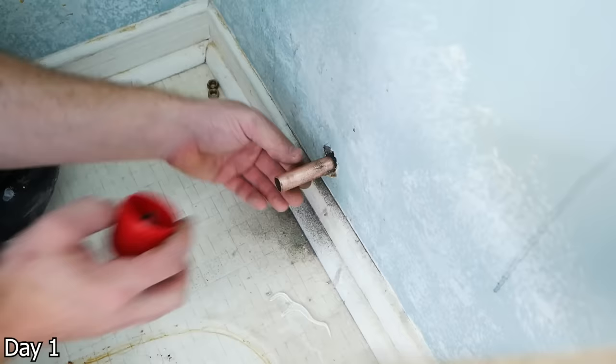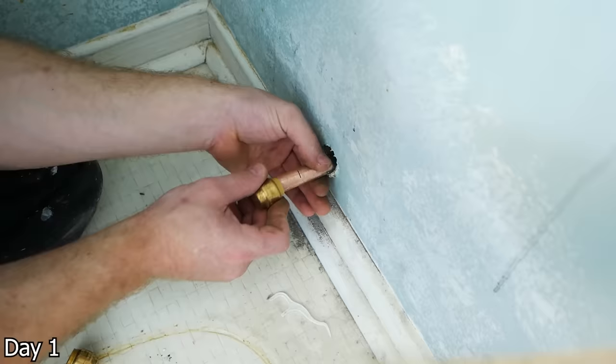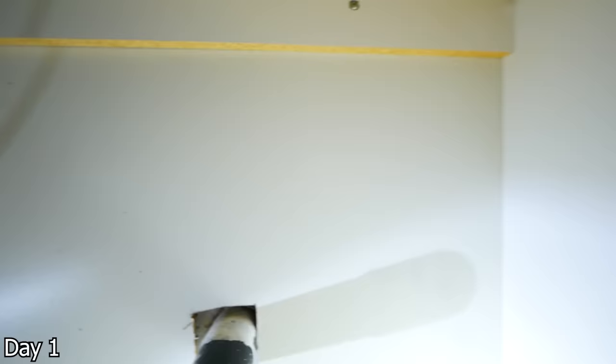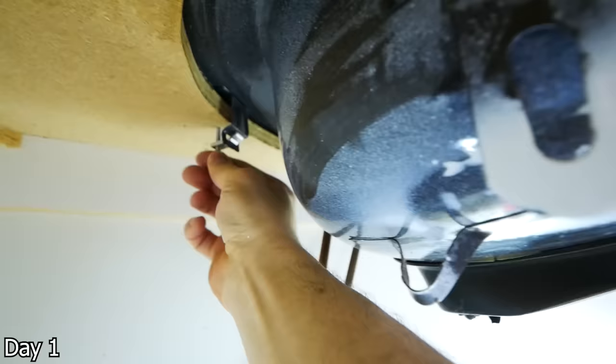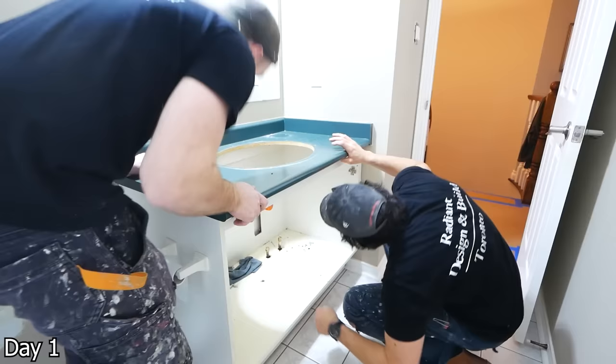Take a deburring tool to ream both the inside and outside of the copper line, getting rid of any sharp edges. Then use a SharkBite depth setter, put the tool on, make a Sharpie mark, and use a SharkBite end cap to temporarily cap those water lines. The vanity is typically held in with just a couple of screws going into the wall framing at the top. Remove the sink to get access to those screws, then cut any caulk joint along the top with a knife. With that done, your vanity should just come right out — just be careful and mindful of those water lines coming through small holes as you lift it out.